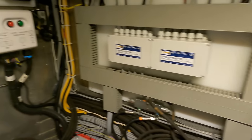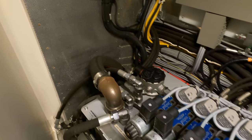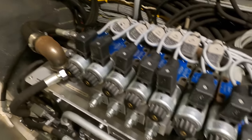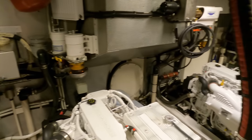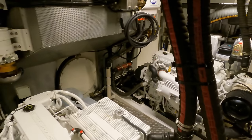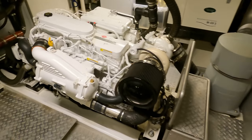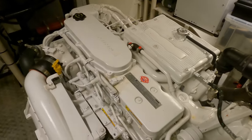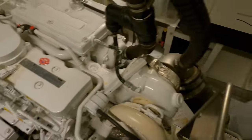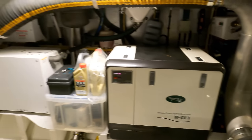Her innovative S-line hull means that the yacht only uses 2.66 litres of fuel per nautical mile at displacement speed. The Steeler 59S has been meticulously designed to ensure serene comfort by minimising disturbance from the engine room. To achieve this, each engine, pump and fan is installed with flexible hose connections, which significantly curbs vibrations, contributing to the overall tranquility of the yacht.